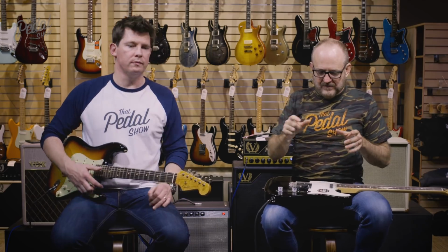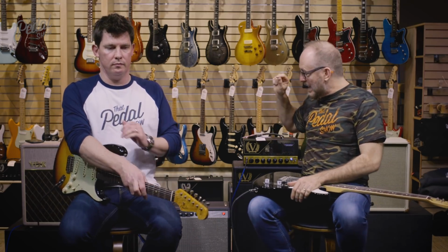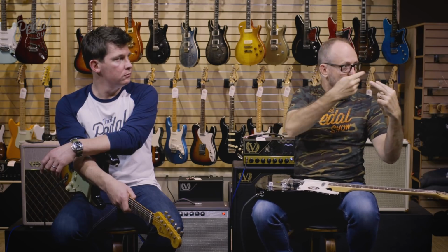What you want to do is have the second output, the output going to the second amplifier, isolated with an audio transformer. There are lots of devices that do that, but it's also really good if that device can also flip the phase. All that's happening there is you've got an audio transformer with a primary and a secondary. Your signal goes into the primary, it's duplicated on the other side of the transformer, but there's no earth connection there, and that goes into the second amplifier.